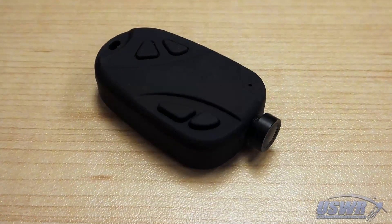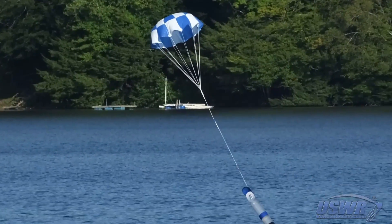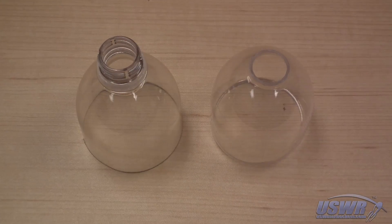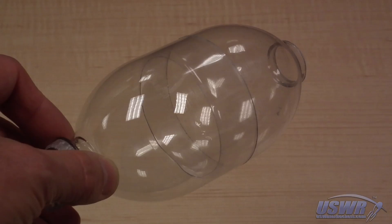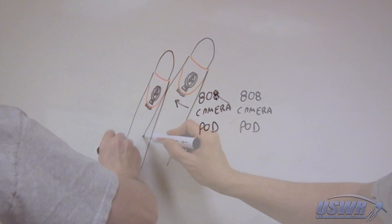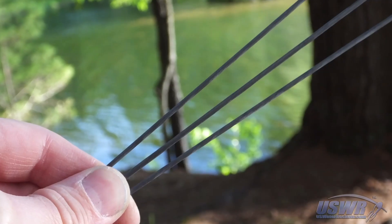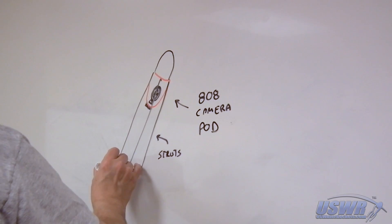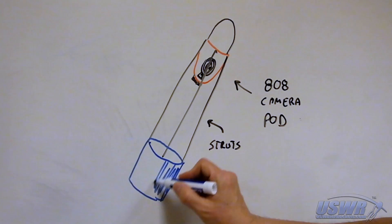Because our primary launch site employs a body of water for the landing area, we had to design a waterproof camera pod to contain the camera and keep it from getting wet. The waterproof shell of the camera pod was fabricated using the bottle shrinking technique developed in our bottle splicing tutorial, only they were not glued together in this case. After that, we fabricated carbon fiber rods which we used as struts to hold the camera in position above the rocket. A cylindrical section of a soda bottle was attached to the struts so that the pod could be attached to many different rockets which we launch.